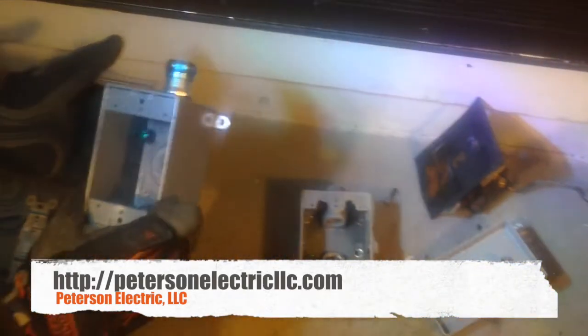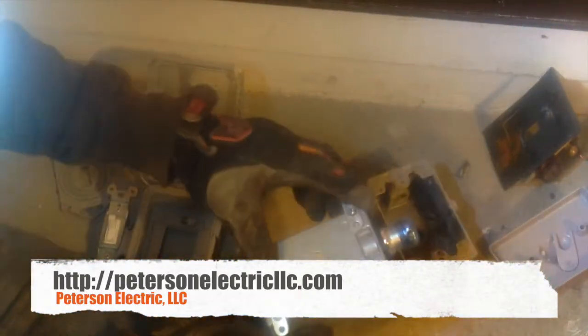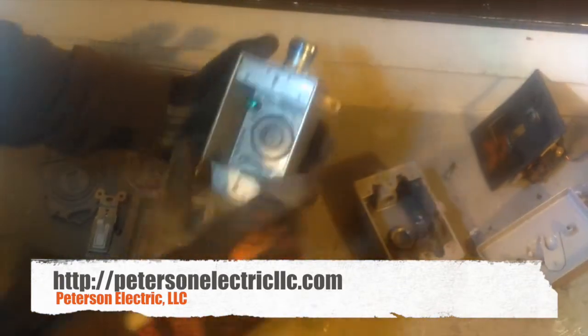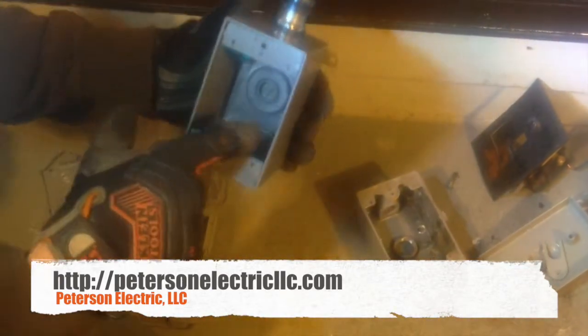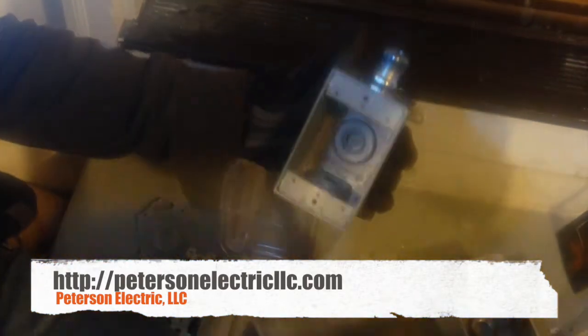I use just another bell box — I like the deeper ones rather than the shallow. They're a half-inch knockout with three holes. They have wings on the outside to screw in, so you don't hurt the inside integrity of that wet area, which is considered R3. As soon as you drill the inside, it's not considered R3 anymore.